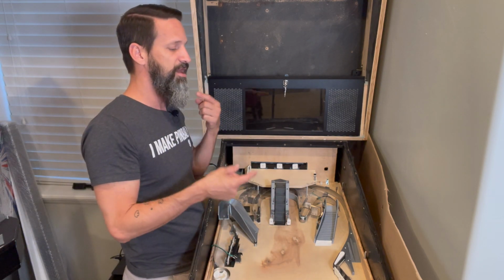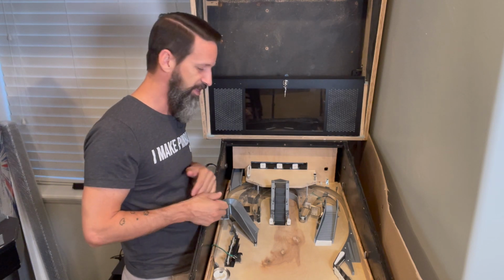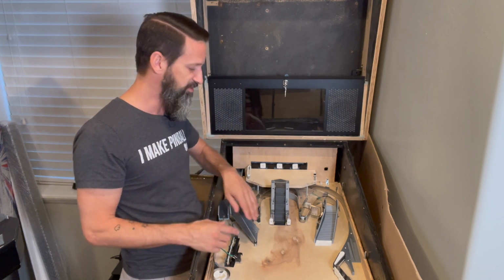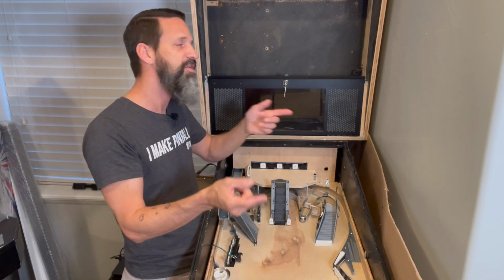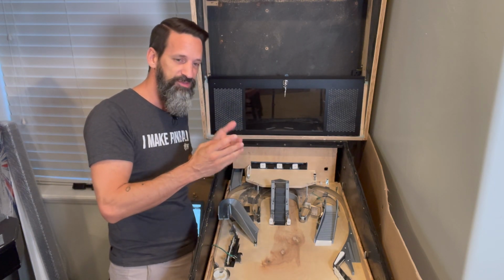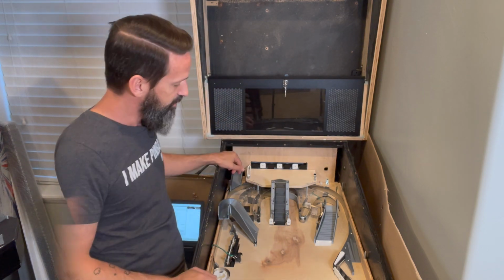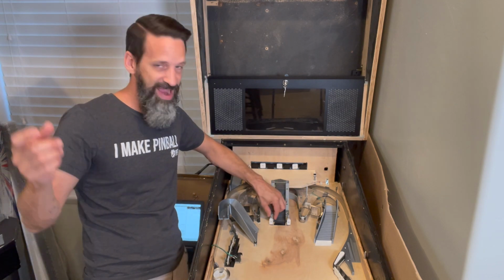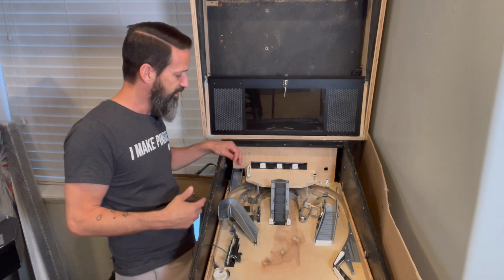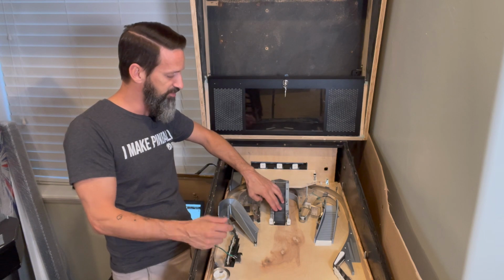I need some custom software, which one of our buddies, Anthony Winkle, is going to give us, that I'll share out with you guys, which is going to allow us to make this a relative movement. So every time it gets hit, it's going to move forward 50 steps, regardless of where it is. So instead of trying to move to position 50, it's going to move to the current position plus 50. Now, you can get around that a little bit by saying what the maximum position is inside MPF, but I don't want mine to move to a certain position, to move to step 3.